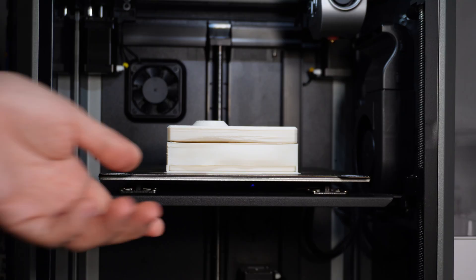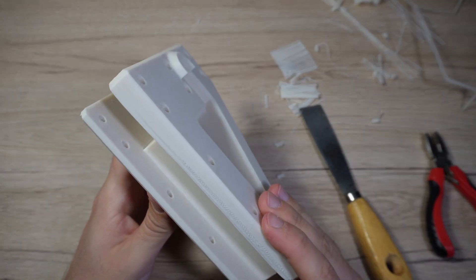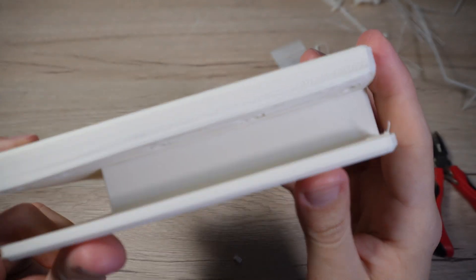The quality I was getting out of the ASA was not enough. The faces resting on the support material tended to shrink a bit more than expected, which means they basically lifted off the support material and ended up with a bigger gap. A bigger gap is not ideal for this application since the part is sandwiched on the aluminum profile and requires a quite tight fit.